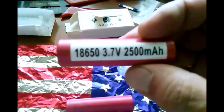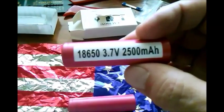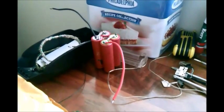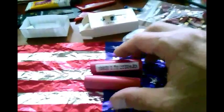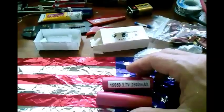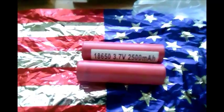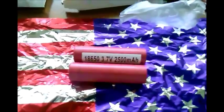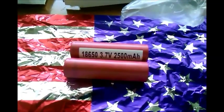So, to see what the difference is between the Panasonic 18650Bs — the 3400 mAh ones that I ordered that haven't showed up yet — and my laptop batteries, those are Sanyo 18650Y, I think 2150 mAh. For people who don't know, mAh is milliamps per hour, which is theoretically how long the battery can last under normal drain conditions. But these are obviously going to be going into a radio controlled vehicle, so there's going to be a lot more amperage drawn. I saw a video by a man named Trent at My Geek Store on YouTube, and he didn't have any problem running his RC controlled airplane that he built.